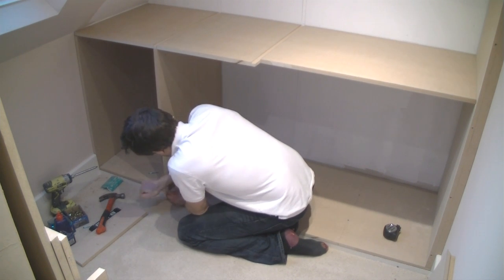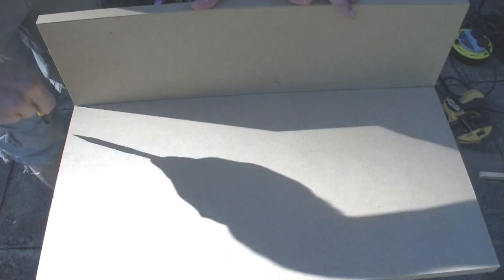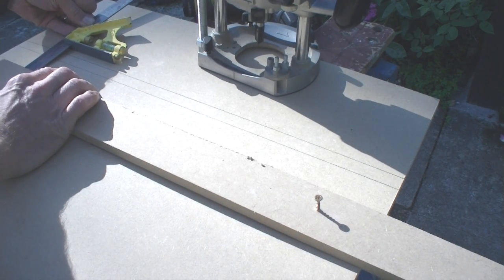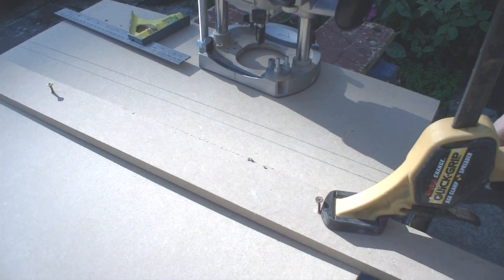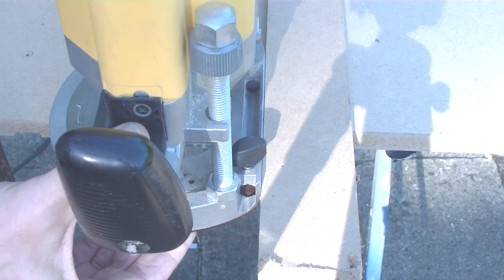The panel can then be fixed to the horizontal panel above quite easily with screws. The router is a great little tool when your workshop is mobile and you haven't got a high-tech room with lots of equipment. To create the channel I marked the 18mm MDF groove I was trying to create, lowered the router into place onto the line, then screwed down a guide piece measuring it against the line to make sure it's in exactly the right position all the way along. I found that clamps can slip, and as the screw only leaves a tiny hole that can easily be filled, screwing is a much more reliable method. Then it's just a question of lowering the guide so the blade projects four or five millimetres into the wood.